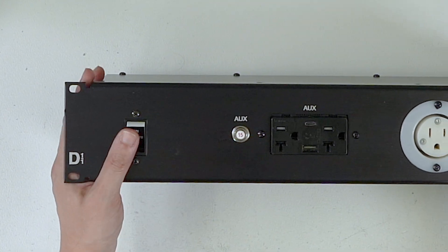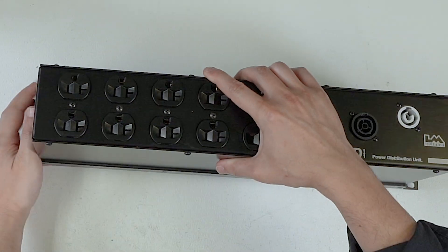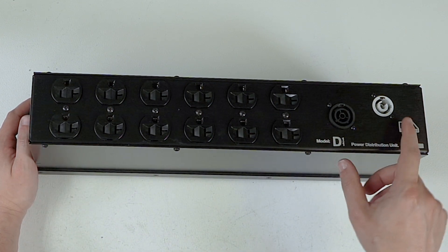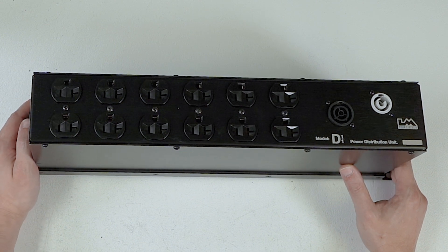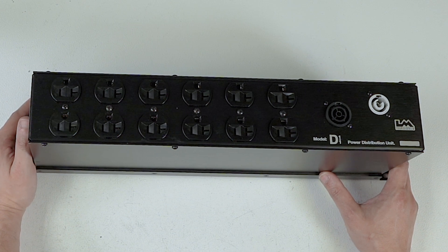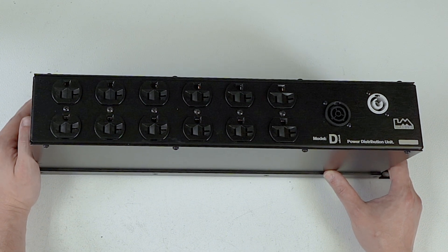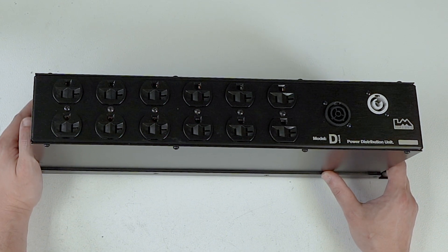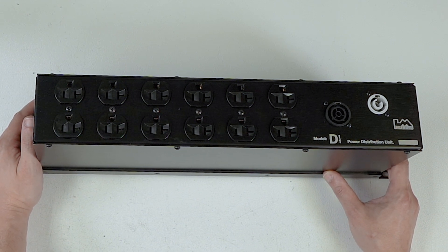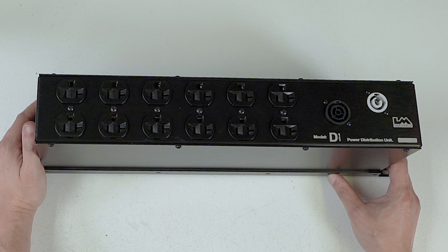You also get a heavy-duty hydraulic 20-amp breaker on the front that shuts off everything in the box. On the back you get six duplex outlets, one True1, and one PowerCon. You might be asking why all those output flavors — well, sometimes you need outlets in density, and other times you need to feed things in your rack that need locking connectors.